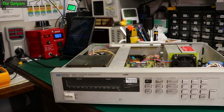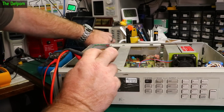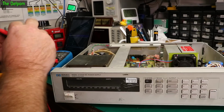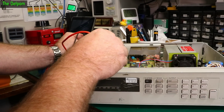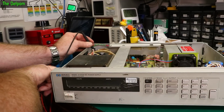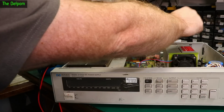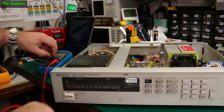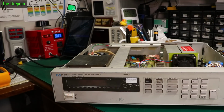Ready? Shall I touch the chassis or not? I haven't done an earth test on this thing. Well, there's the wire. It's fine. I should do an earth test to make sure. Hold on. I haven't done it yet. Earth test. Probably plug it. I can see the pin from here, but anyway. Earth test from here. There's the pin to here. 0.2 ohms. Yeah, no, whatever. Side there. 0.2 ohms. Heat sinks. Probably floating anyway. Yeah, they are. Okay, that's good. It's got an earth. Just to be sure. Okay, now you're ready.